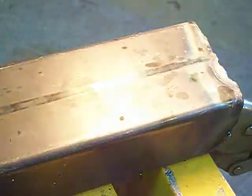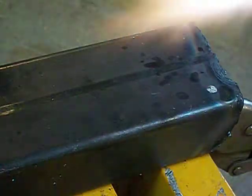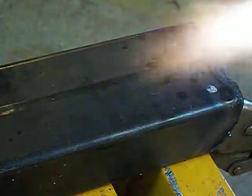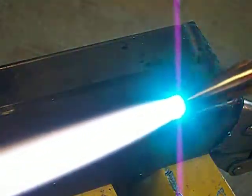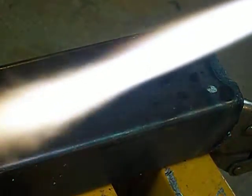You adjust it to get rid of all the soot flames there, as you can see. Then you open your oxygen. I don't want to put too much in there — just like that. Because you probably can't see it too well. So you can see how the flames are adjusted in the torch, where you've got your neutral flame.